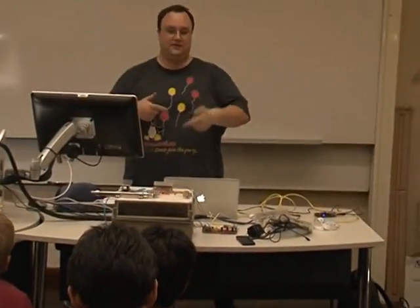We hope to add, it is already very, very simple. The MQTT stuff has been fairly well integrated into Clockwork, in the sense that not only are those points I mentioned, there's also this idea of subscribe and receive commands, such that you can say to a machine, I want to receive something, and subscribe to something, and then when I receive a message, I can process that in my state logic.